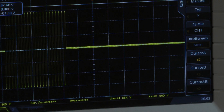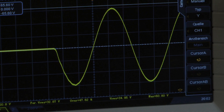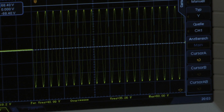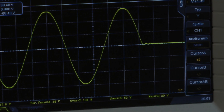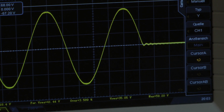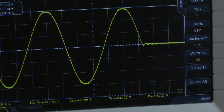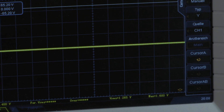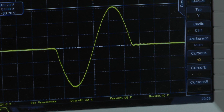Dynamic power test: 1 kHz, 20 cycles. We have all cycles at the same voltage level. The first one shows 60.8 volts. Checking the last one — it doesn't look too good, so I take the top voltage of 59.2 volts. So we have 59.2 and 60.8 volts — that's 112 watts on the lowest cycle and 118.5 watts on the highest. There is no increase in output power at 8 cycles; it stays at 118.5 watts. With just one cycle, the amplifier delivers 128 watts.